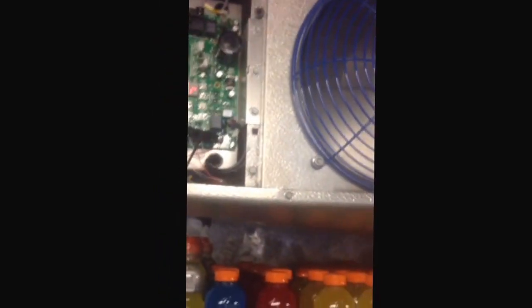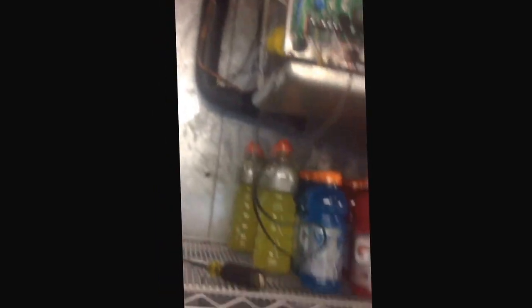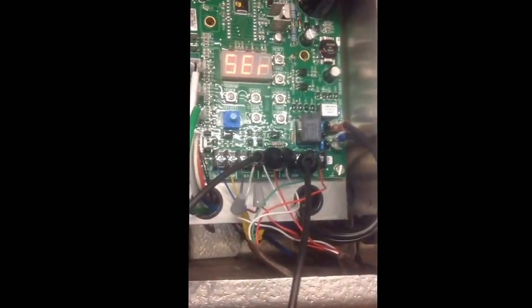What I'm going to do is now go upstairs, shut down the suction valve, take everything in the pump down, and remove that TXV to start.